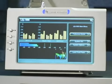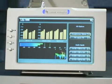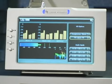The down mix can also be separately selected for the 7 and 8 output. So if you're only working with a 5.1 channel signal, you can check a utility down mix by going into the system options menu, then the IO options menu. There's where you can select whether headphones are stereo or mono just by pressing the next key — it'll toggle between the two. And what should the 7 and 8 output be?